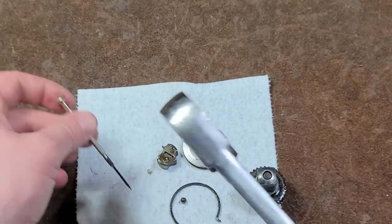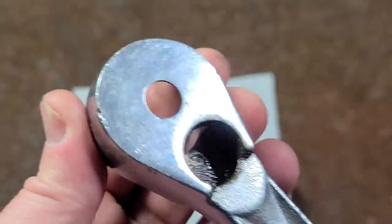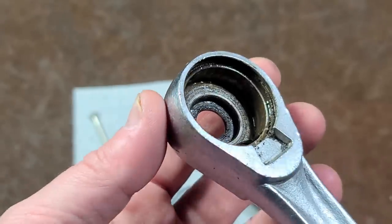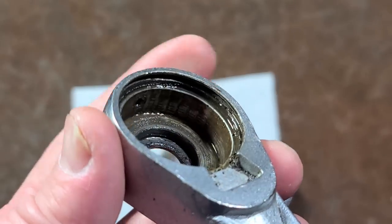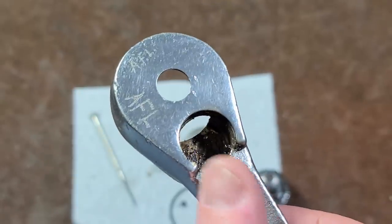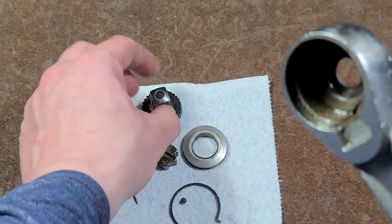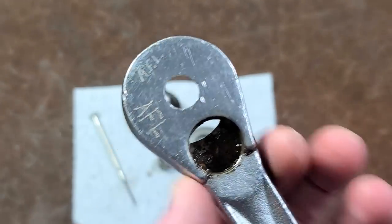This thing's really goopy. I do recommend using light oil — my subscribers have really let me know, and it is true. If you use a high-quality synthetic grease it's not as bad because those don't harden up like other greases, but pretty much any normal grease will do this over time. It loses the oil because grease has oil emulsified in it, and then it slowly leaks out. That's how grease lubricates. But then that base product — especially organic grease — starts to harden up and just becomes really sticky and gross. Definitely some machine work in this, and I really like just how compact it is.